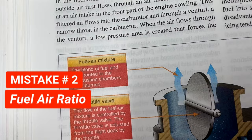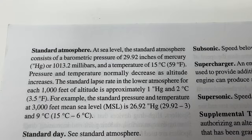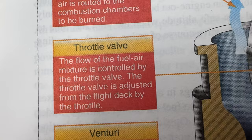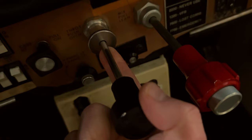The second mistake is pilots not knowing the fuel-air mixture needed to start a cold engine. If you're starting a typical training airplane's Lycoming O-360 during standard or warm temperature days, you might crack the throttle a half inch or so. Remember that the throttle controls the air part of the fuel-air mixture. On a cold day the air is much more dense, so less air is needed — if you use a half inch in the summertime, maybe use a quarter inch in the wintertime.